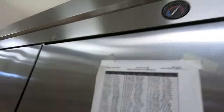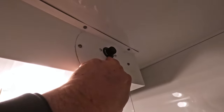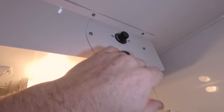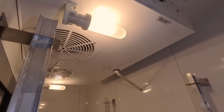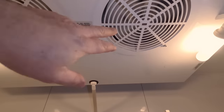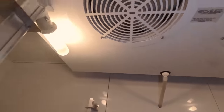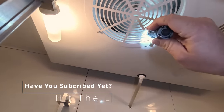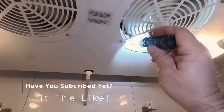What we got here is a True. We've got an old mechanical control here. I can tell because it has the metal screws right there. I want to make sure that this sensing bulb is in the coil, so let's take a look at that. Make sure that all of our fans are running — which they all are. Our coils look like they're clean here, yeah they're clean, so we've got good airflow there.